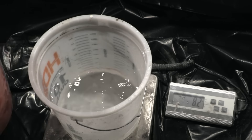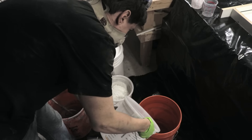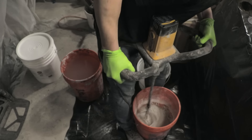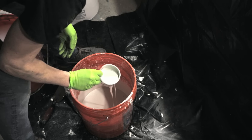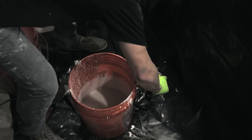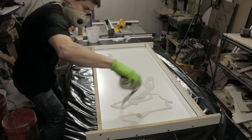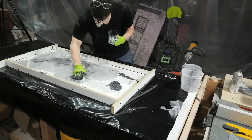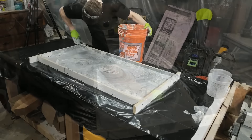Then I went to mix the concrete. I used Fishstone's GFRC pre-mix, which I love and is way better than any normal store-bought mix — I'll have a link to that in the description. I first mix the face coat, and to get the marble look, I set aside a couple of small containers of the face coat mix that are pure white, one that is really dark and almost black, and then I put some Quikrete pigment into the main mix and swirl it so it's an uneven color. Then I drizzle around the white concrete mix, pour in the uneven mix, add in some dark black mix, and just use my hand to swirl it around to get a nice swirled look that I was hoping would resemble marble.